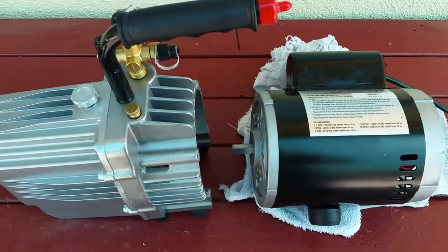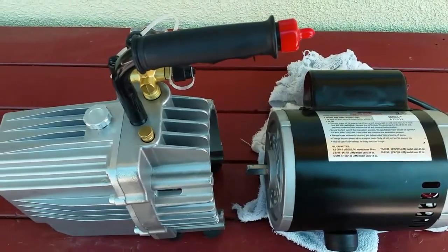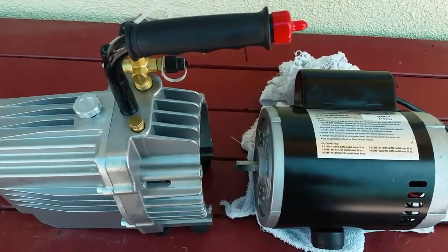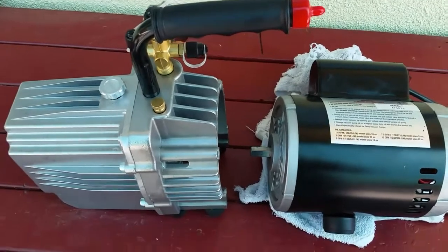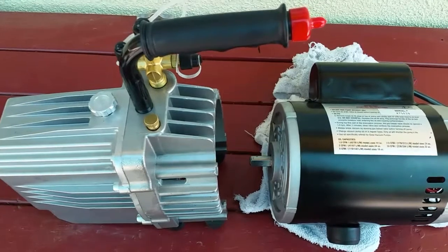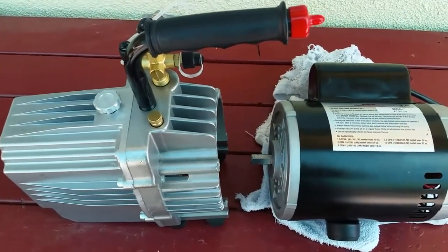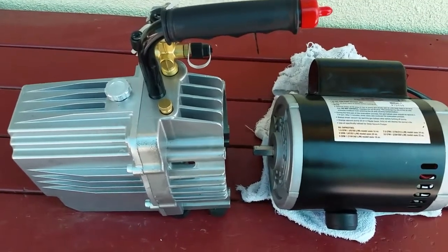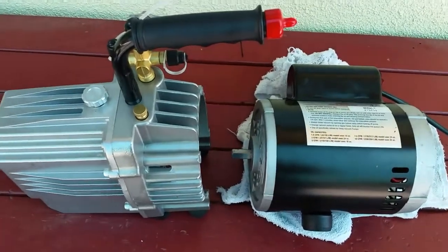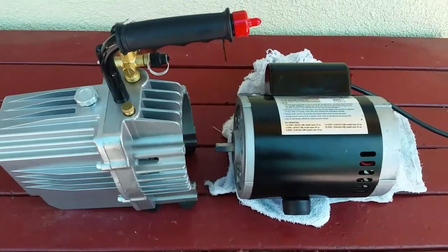It was 6 microns absolute, 6 microns of mercury absolute, which, in plain language, is very, very, very low absolute pressure, or high vacuum. These words get tricky because high vacuum means one thing one time and the opposite another time, depending on who's using it. So the convention is the values are given in absolute terms for vacuum, for laboratory work or high vacuum, or when you want to take as much gas as you can out of a system. So 6 microns, lower the number the better.